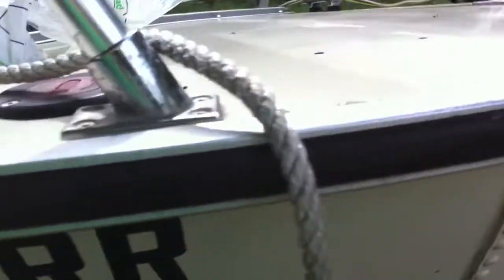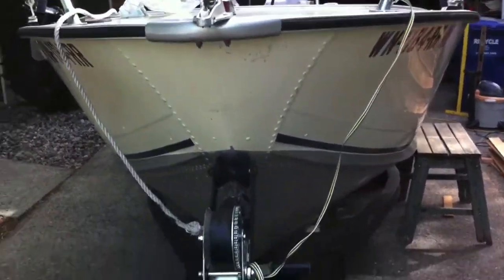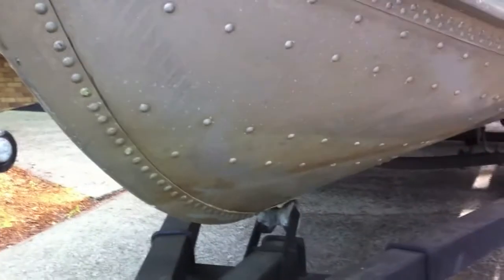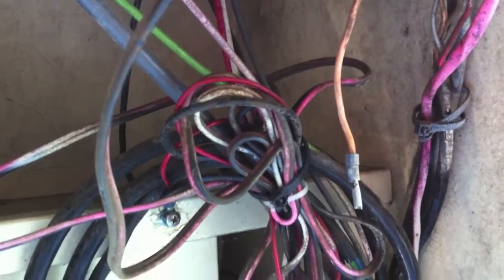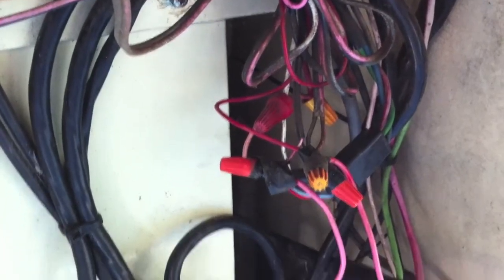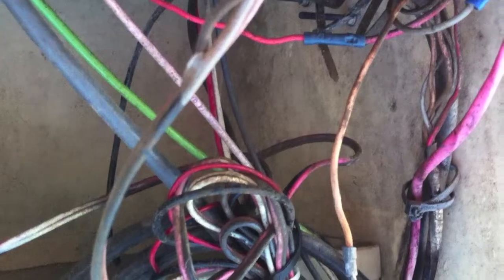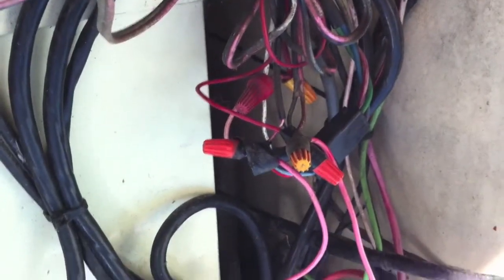I heard one of the pumps turn on. There's a bilge and that's the fuel tank vent - I guess that was added afterwards because this boat probably had portable tanks originally. There are no dents in this thing for how old it is. Don't do this to your boats, guys - using wire nuts and just homemade half-assed wiring. That'll get you on the water quicker for the weekend, but you're probably not going to get back around to fixing it.